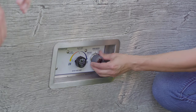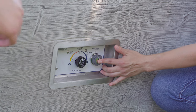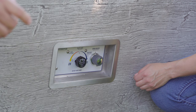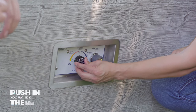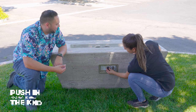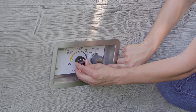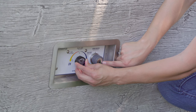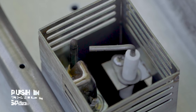So what you want to do is flip the battery in the correct way and reinsert it. Screw the knob back on. You might want to give it a little test — go ahead and test it. You hear clicks? Good. So now what we're gonna do is on the knob, you're gonna push it in. What this is gonna do is allow gas to flow up to the pilot. Give it about 15 seconds or so and wait a little bit. Now we're gonna hit the spark igniter.